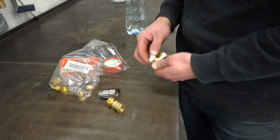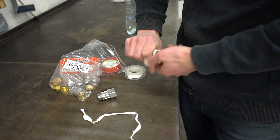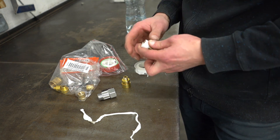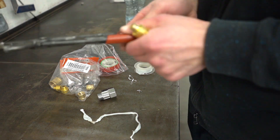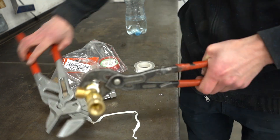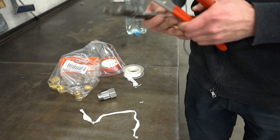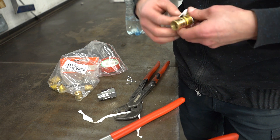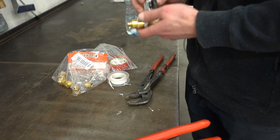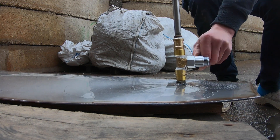The contraption I'm putting together here is basically a safety precaution. I decided to add a valve to release the pressure — more specifically to release the gases, the air out of the vessel, before applying any high pressure. I decided to do that after watching YouTube videos, specifically Colin's first video, where he explained that gases are compressible and therefore can explode, while liquids are incompressible and therefore safe under pressure. That made total sense.